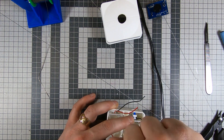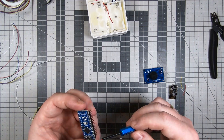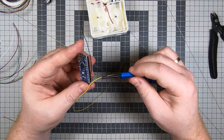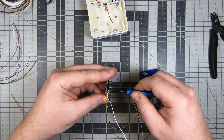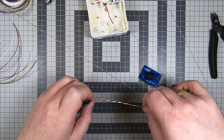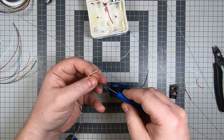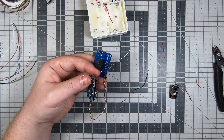While Chris stepped out, Mike stepped in and did the wiring. They prefer the old-school technique of wire wrapping, which gives a more reliable connection than jumper wires, and is both faster and cheaper than crimping. As a bonus, the completed build takes up less space and looks better when the wires are twisted. The wire diagram can be found in the description.